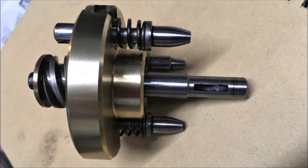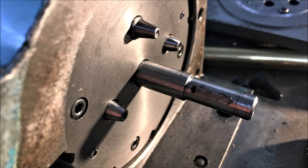This assembly is largely responsible for the way the turret works. You can see the woodruff key there - that's for a gear. The gear drives it backwards and forwards, and when it goes one way those pins are retracted along that thread that you can see at the left hand side, and when it reverses the pins are pushed out into a plate.